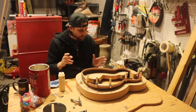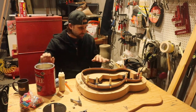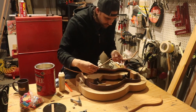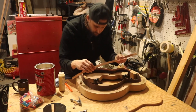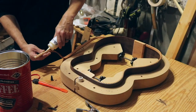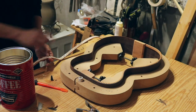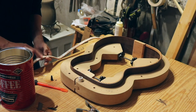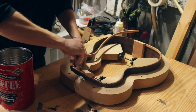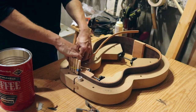I'm probably going to have to turn the camera off because I need to focus. I've got 50 clothespins with rubber bands on them - that's all I've got and it takes about 50 to do one side. I'm being careful not to break the kerfing. I think I cut the opening on that glue bottle too big - it comes out pretty fast. This is one of those things where you're trying to move fast but slow and methodical at the same time.